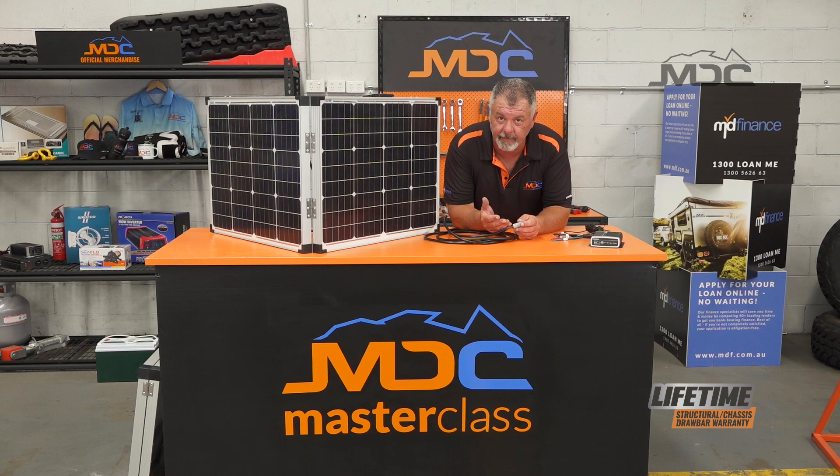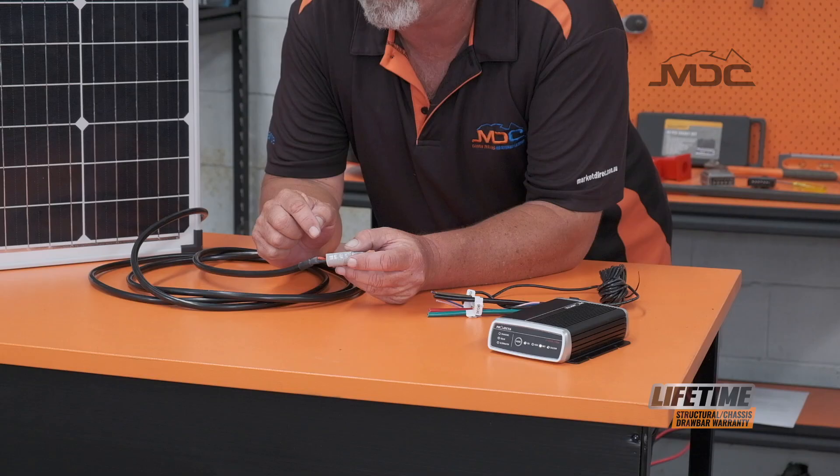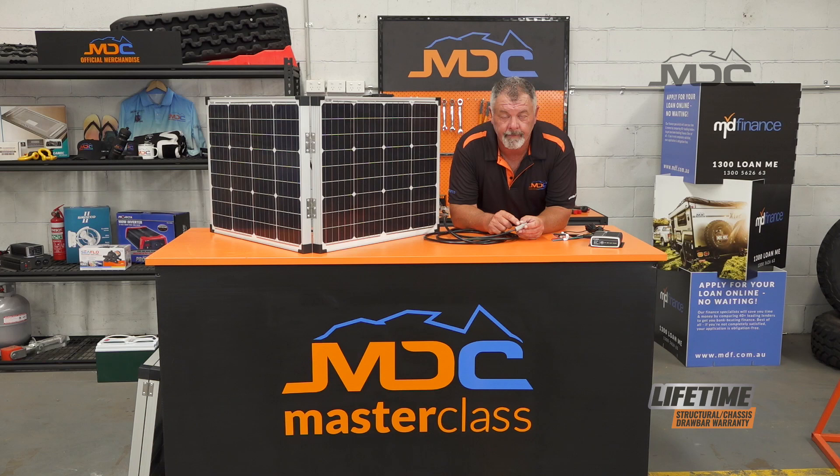As long as they're regulated panels they'll do the job — they'll charge the batteries. If you've got say a 120 watt panel and a 180 watt panel, you will get exactly the combination of the output of those. If you run them in series — positive to negative like a series of batteries — you will only get the multiple of how many panels you have times the lowest value panel. So don't do it that way; you only do that if you want to increase the voltage output of the panels.